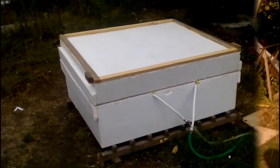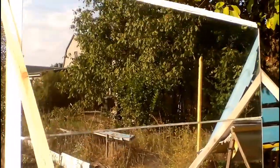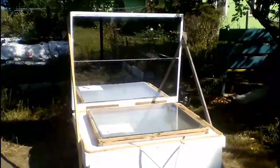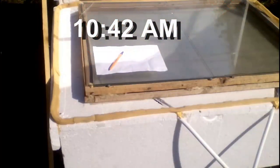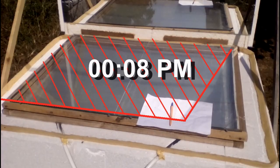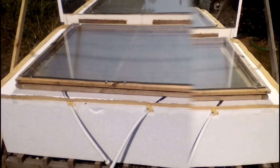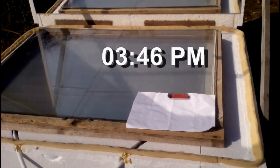I rarely used this opportunity, and usually the cover has this position both day and night, and here we see a mirror on the inner surface of the cover. We must pay attention to the edges of the spot of solar radiation from the mirror at different points in time for one day, and it is obvious that the spot moves due to the movement of the sun from morning to evening. The additional radiation from the mirror significantly increases the water heating temperature and heat production.